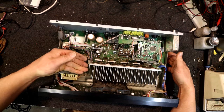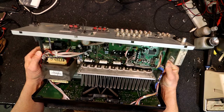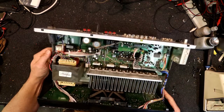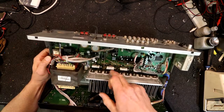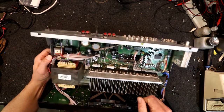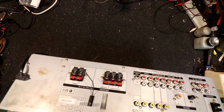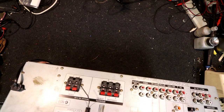The transformer is actually still warm, even now, and I haven't run it for a while. Some of these electrolytics look a little bit like the plastic's starting to peel back. I'm not going to bother recapping the whole thing, but I'll definitely be checking the ESR of the ones around these driver chips, and probably the ones up against the resistors. It could also be somewhere in the signal processing, but the board for digital optical connections I won't worry about because I don't use that.